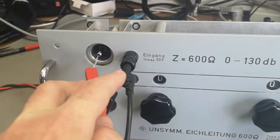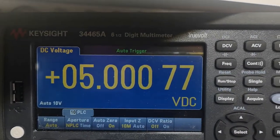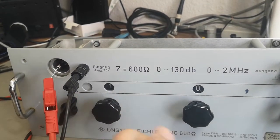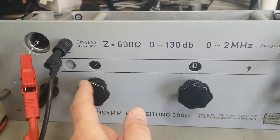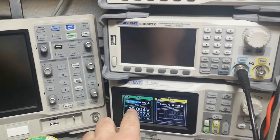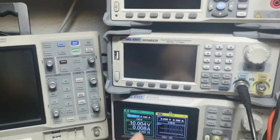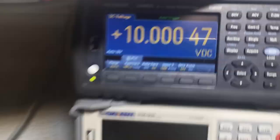10 volts with 600 ohms and another 600 ohms to ground — that is why we got 5 volts. This reveals the accuracy between my two resistors. So what if I go 20 dB? That is a factor of 10. Now I got 0.5, not 5 but 0.5 — almost right. Let's get back to zero and adjust — I'll dial the input voltage up to 20 so I get 10. This is now my new reference.